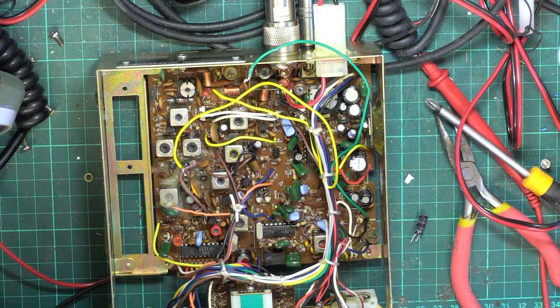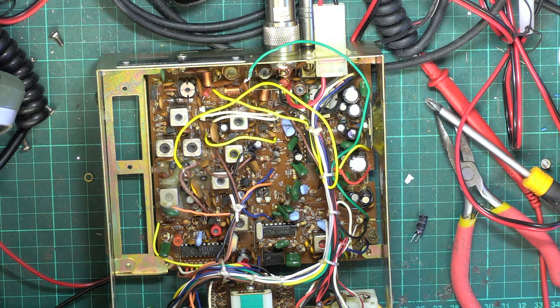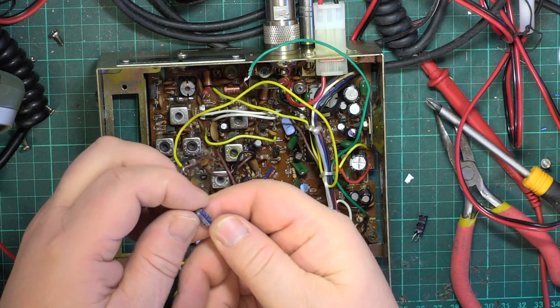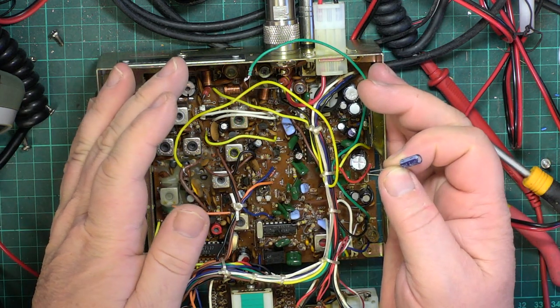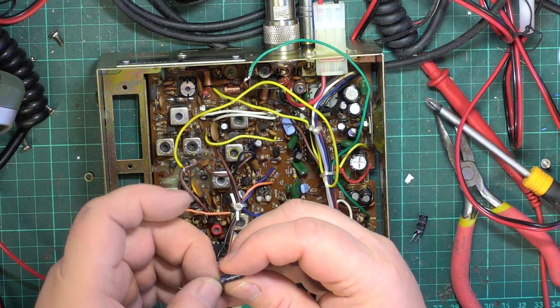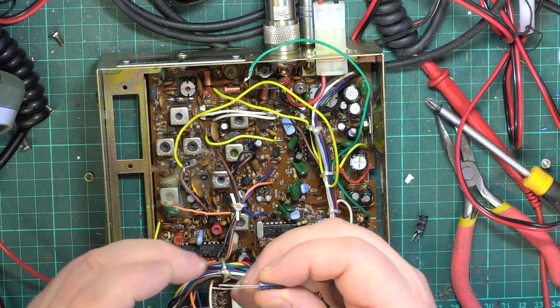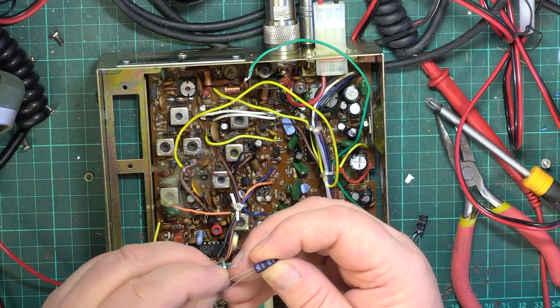So I'll get a replacement capacitor, and we don't have the 16 volt ones, and once again it'll be upgraded to 105 degrees because that's what we stock. So I suppose when it's got the lids on and with that potential short circuit around the synthesizer, that probably got very hot and then shut down, as he says.